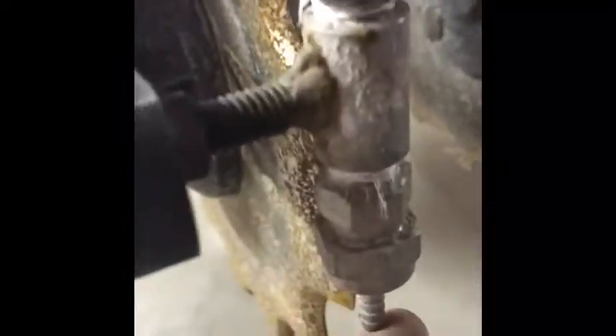This is a seed firmer — it goes in the trench, secures the seed, and lays it flat with pressure. This tube sprays fertilizer into the trench. Then we've got the Yetter side-by-side fertilizer applicators. They've got discs that cut alongside the trench because you can only put so much inside it, and they spray right into that small open slot the blades cut. The closing wheels come through and pinch everything together.